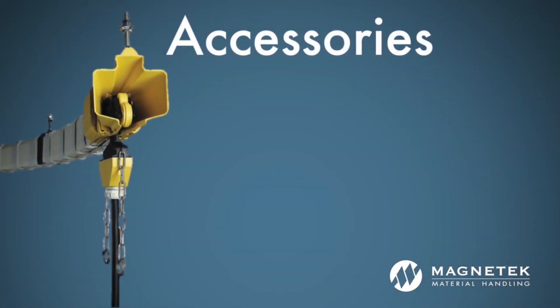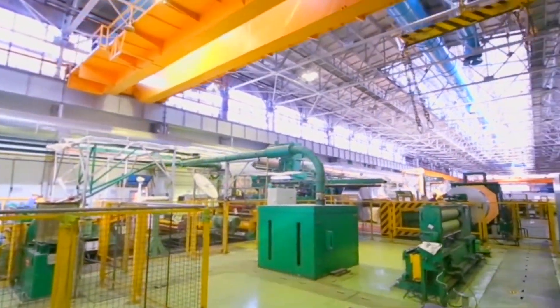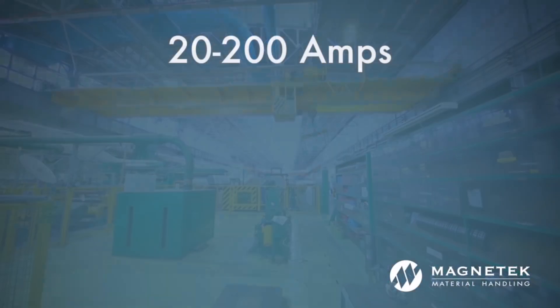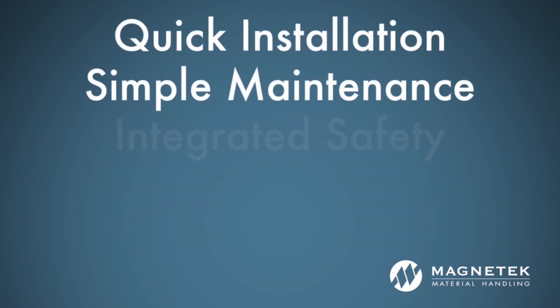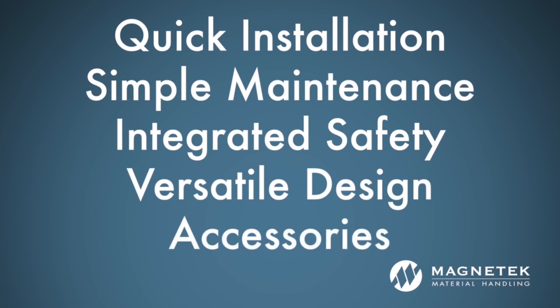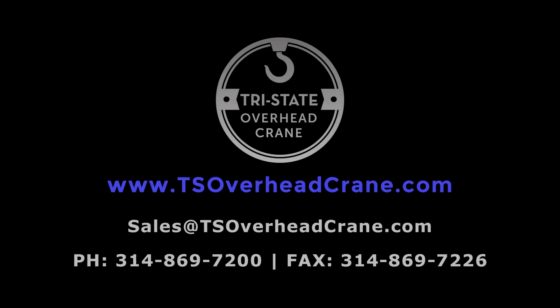Transfer funnels, curved elements, dust seals, and expansions are also available. ElectroBar Elite provides unrivaled power delivery for overhead cranes and monorails, ranging from 20 to 200 amps in 4 and 5 pole configurations. Offering quick installation, simple maintenance, integrated safety, versatile design, and a broad range of available accessories, ElectroBar Elite is a top-of-the-line conductor bar system.